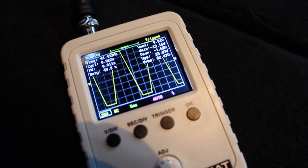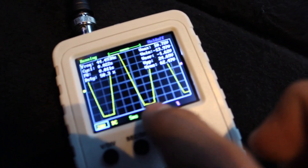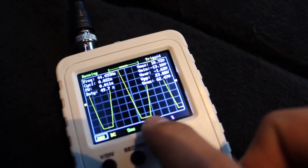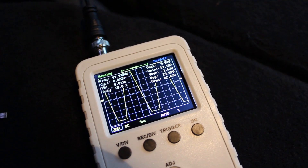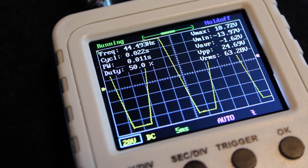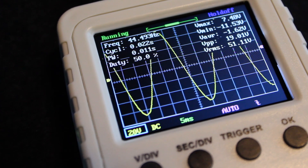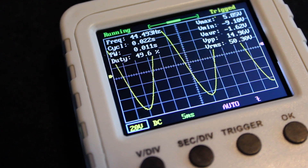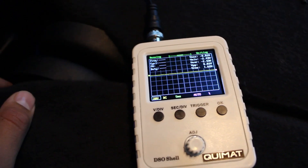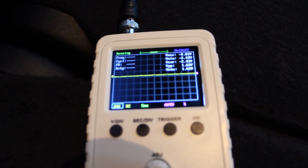Let's check for clipping. See the bottom of the wave how it's flattened out — that's clipping right there. To get rid of that, you just turn down the gain on the amplifier. Turn the gain down until the waves get round. Right there is where you want it — no flat. Now we have our gains properly tuned on the amplifier. I'm going to post a link below to the oscilloscope on Amazon. We'll see you next time.